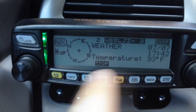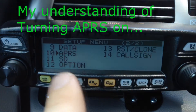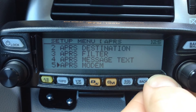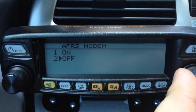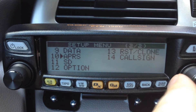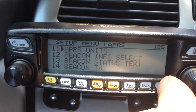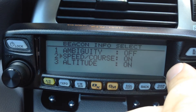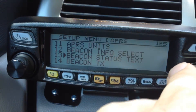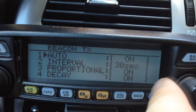There's one YouTube video out there on the FTM 100 showing how to set it up, but he does it incorrectly. Let me show you how to set up automatic beaconing. Go to menu 10. On that video he tells you to turn the modem on — you do need the modem on of course, to listen and transmit. He says go from off to on and claims that's all you need and it starts beaconing — that's not so. What you need is to go down to your APRS beacon settings. You can check info: speed, course, altitude — I've got all that on, ambiguity off. Then go back, go to beacon status text, beacon text, beacon transmit. This is what you need to have on. Go to menu 1 and go from off to on.